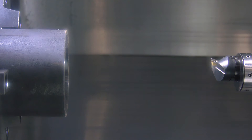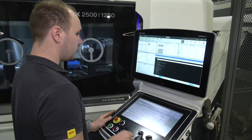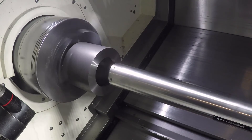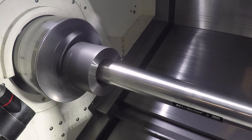Now we're going to start with a medium rough cut. We have 200 meters per minute surface speed, a 1.5 millimeter radial depth of cut, and 0.3 millimeters per revolution in feed. As we enter the cut, we can see the surface roughness stabilizing around the medium rough area as expected. Temperature is completely okay and there are no vibrations — it's a stable cut and the operator can be happy.